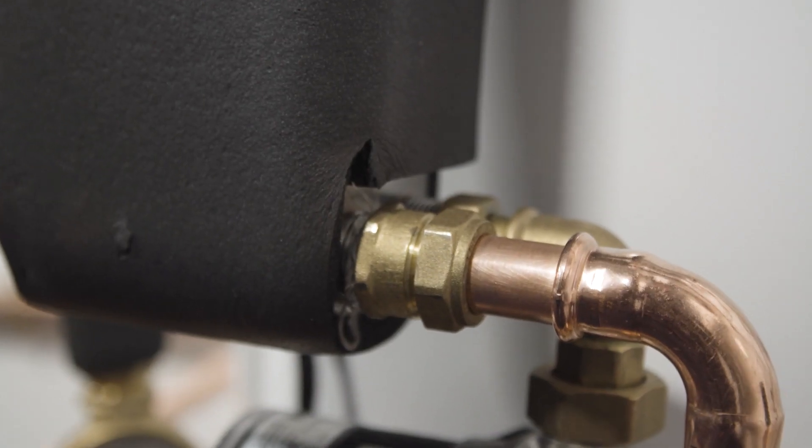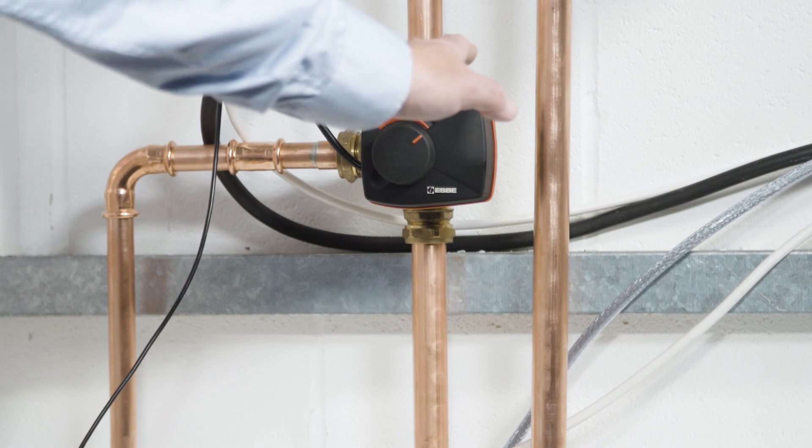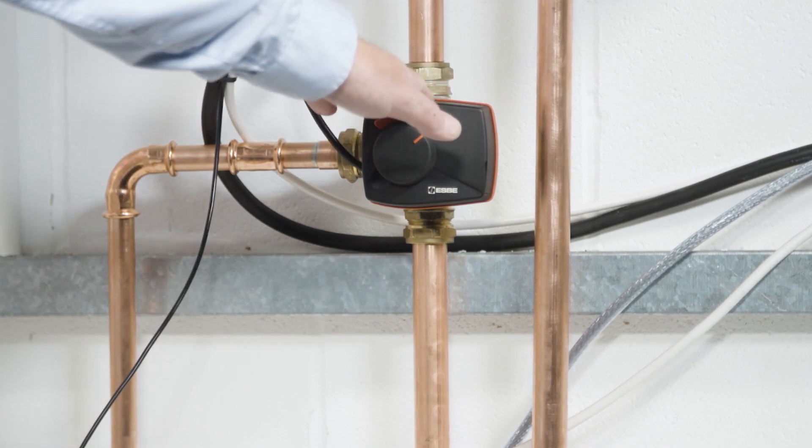The flow from the heat pump when working in hot water mode leaves the diverter valve, is then piped into this three-quarter inch boss at the top of the plate heat exchanger, passes through the plate heat exchanger, then back out at the bottom into the return circuit. Mechanically, everything external to the heat pump heat exchanger is identical to any normal heat pump heating and hot water system.